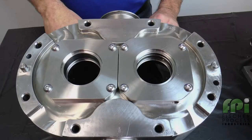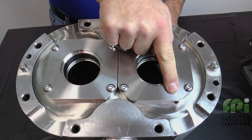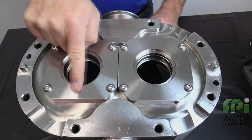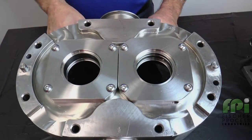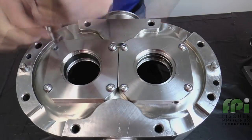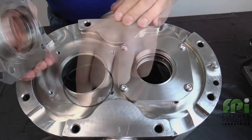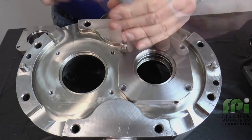For illustration purposes, the pump body shown here includes a seal housing for a double O-ring seal located on the right, which contains a flush hole, and a seal housing located on the left for a single O-ring seal that does not include a flush hole. Please note the position of the flush holes when removing the double O-ring housings for proper placement during installation. Once the pump body has been removed, remove the four retaining bolts from each seal housing and remove the housings. Remove and discard the seal housing O-rings.